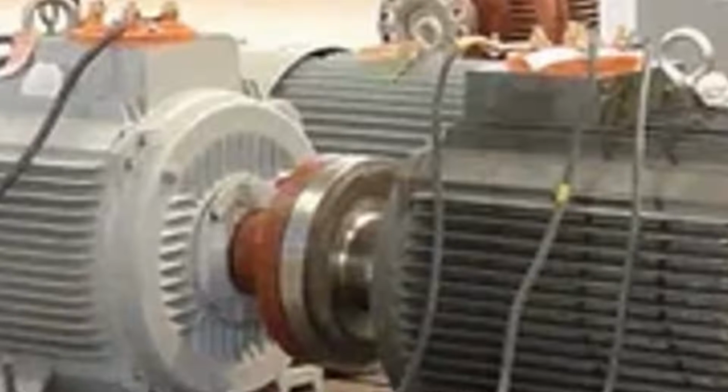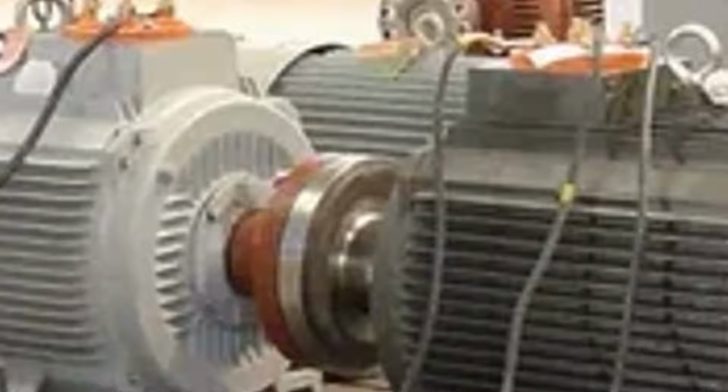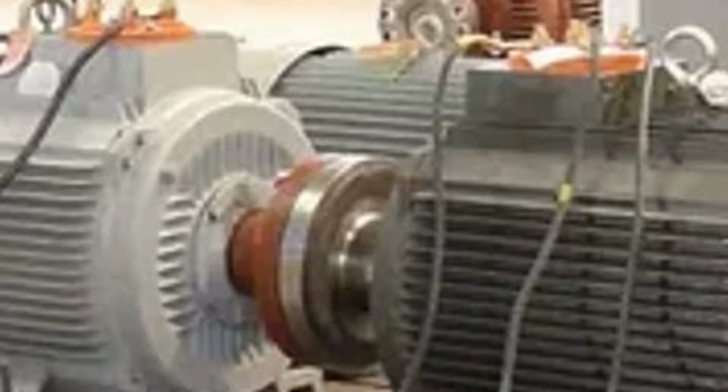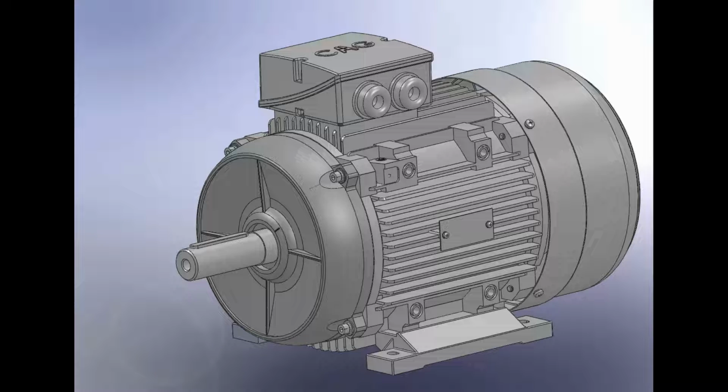Operation of a large synchronous motor at such a leading power factor may be an effective way of improving the overall power factor of the electrical loads in a manufacturing plant to avoid additional electric supply rates that may otherwise be charged for low power factor loads. Three-phase synchronous motors find their major application in industrial situations where there is a large, reasonably steady mechanical load, usually in excess of 300 kilowatts, and where the ability to operate at leading power factor is of value. Below this power level, synchronous machines are generally more expensive than induction machines.